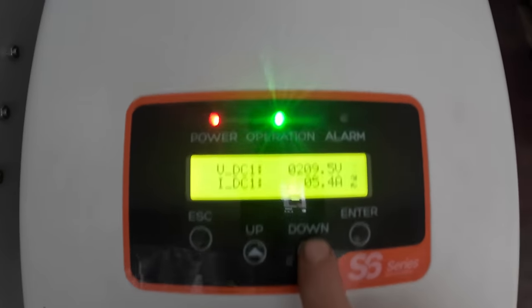I thought I'd show this running at quite low flow — you've seen it at max, and a lot of people only want to see peak output. But hydro is not all about that. Hydro is about slow, steady, reliable consistency and working at a range of flows. At low flow we don't get any splashing and we're much more efficient. I'll show you how much power it does at a sort of summer flow. The buckets aren't that full, but there's no splashing — it'll still be making quite a bit of power.